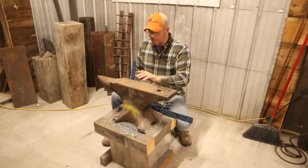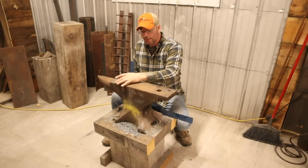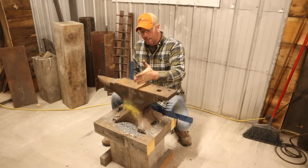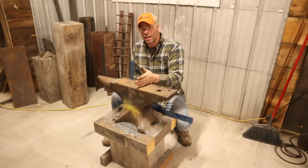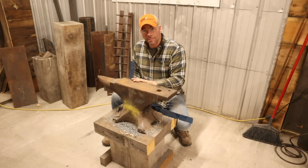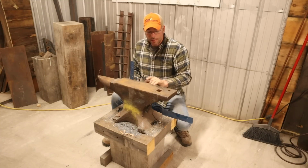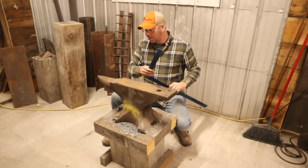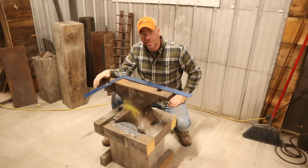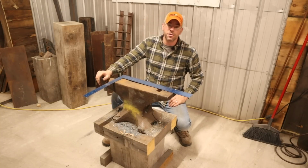Now, I'm going to use 7018 AC rod to build this up. What we're going to do is build up a butter layer. We're going to work in the parameters here. We'll draw a couple lines to start. Every time we're done welding a layer, we're going to beat the hell out of it with a hammer. Now, I found before with the 7018 on the railroad track anvil that I made that it work hardens really well and really fast. So that's where we're at. So let's get you guys a close-up, and then we're going to get to cleaning this up. We're not going to do any welding on this thing tonight yet because we have to heat this thing, and I do have an idea to kind of help that along, so stay tuned.